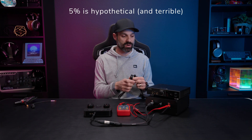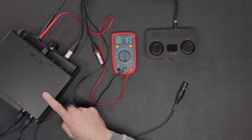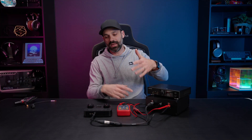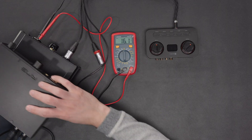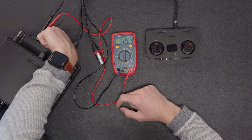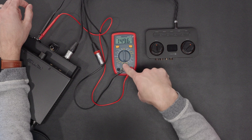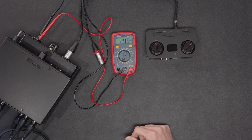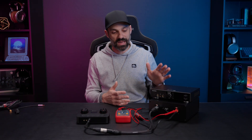Most manufacturers should be reporting power at sub-1% THD; it's rare but some go to 5% or ignore it altogether — worth noting. I plug the XLR cables from the back of the RME into the dummy load's ADC input. Once connected to my PC and playing a test tone, all of this process happens and I can monitor everything. So with 16 ohms loaded up — if I switch this knob to 32 ohms, look at that — then 150 ohm reads 149.1 to 149.6, very accurate. Switching to 300 ohms requires the 2k range on the multimeter, which reads 299 to 300 depending on the moment.